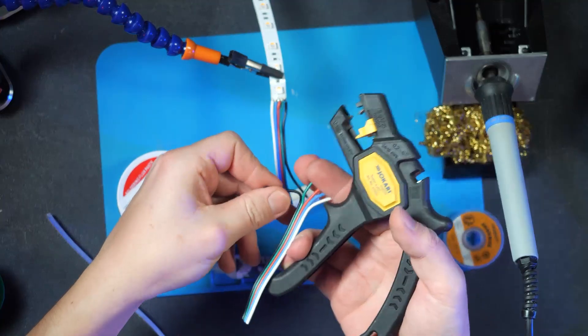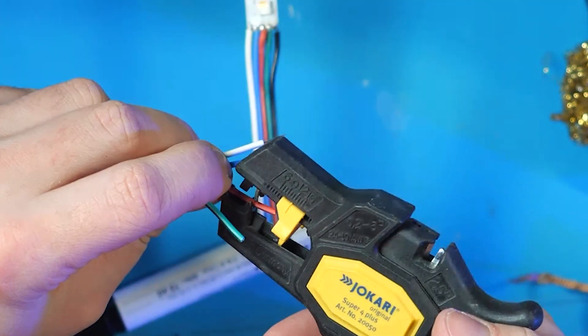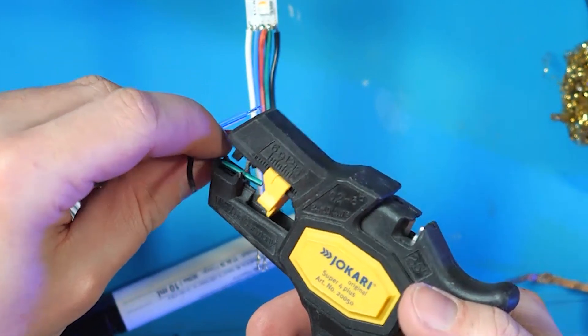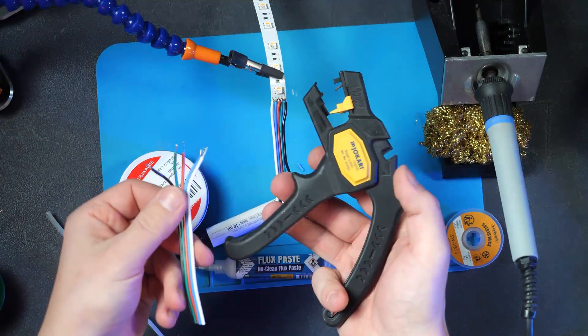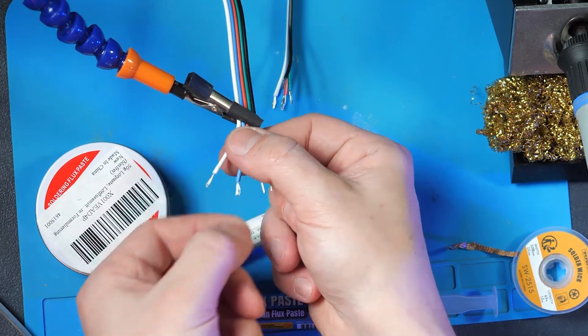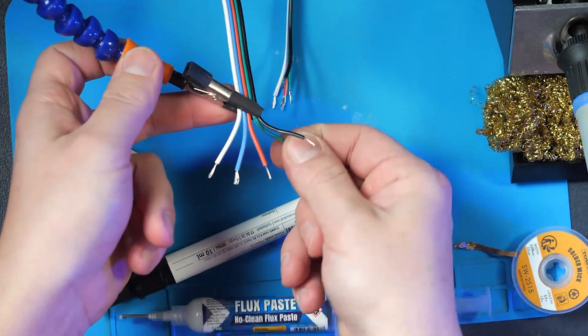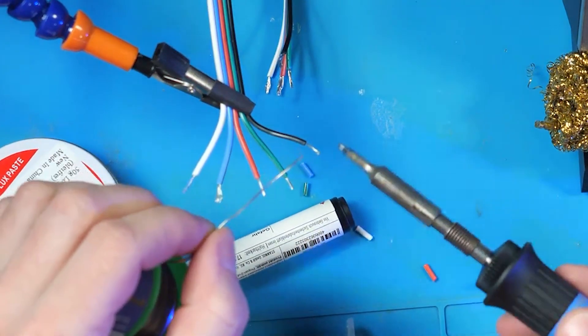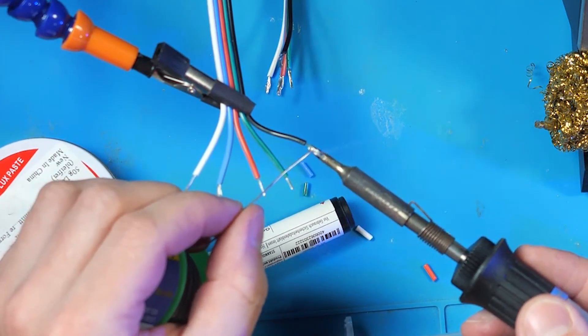RGBW is the hardest one, so we try this of course. Here you don't have so much space and you should be super careful that the wires are not touching each other. I pulled the wires apart a little — we just need a little bit. I typically unstrip them a little longer and I'll show you in a second why. I also link the tools I'm using down below. Then I slightly twist them — not too much, just so that there is no single wire standing out.